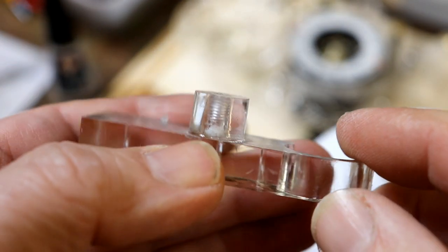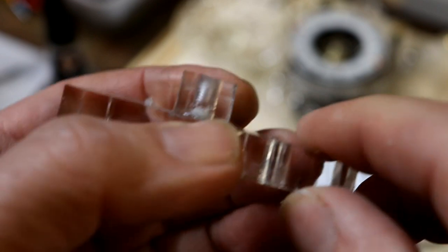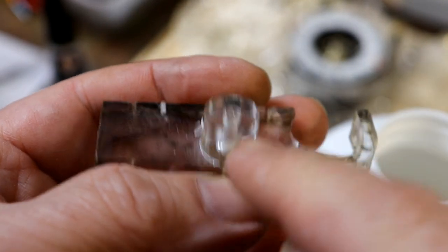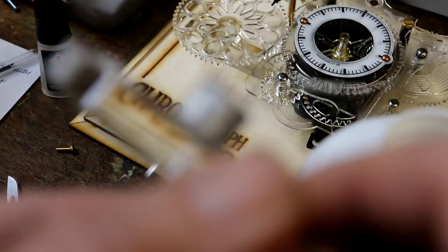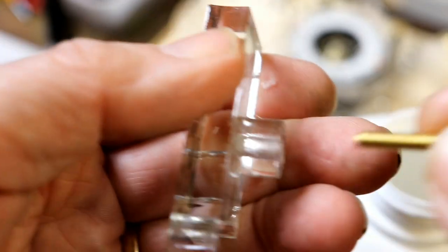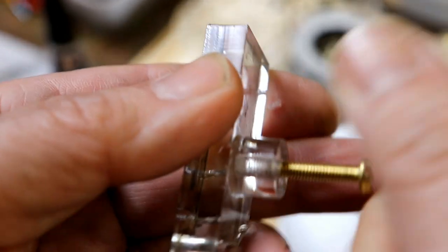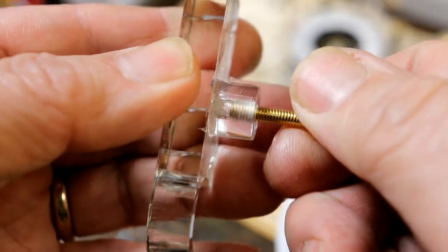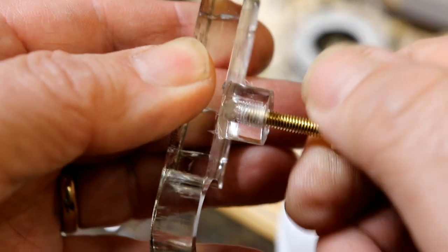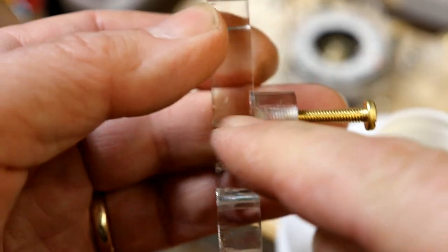Focus there. I couldn't go right through, obviously, because I'd forgotten to put the hole in this bit. I was just testing to see if the hole the laser had cut was the right diameter, and I'm very happy with that. If I get an M4 screw, yeah, that's nice. Not too loose, perfect. So now I'll just copy that size hole I cut down through into this one.